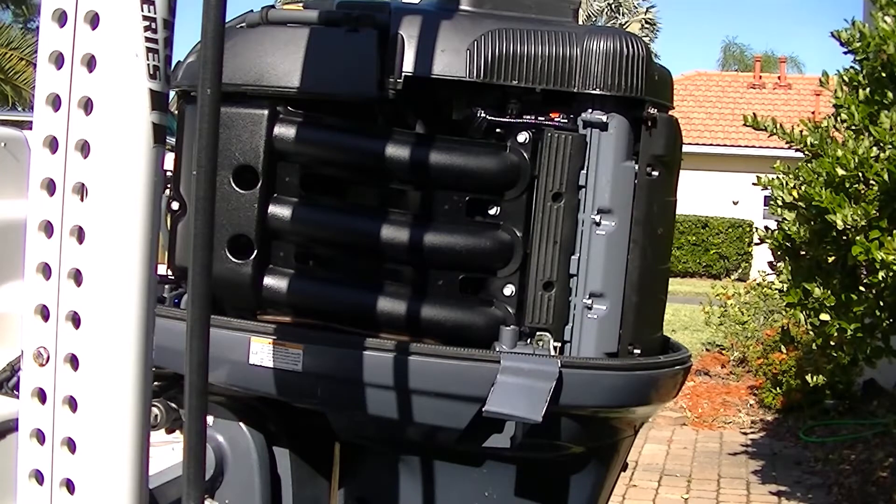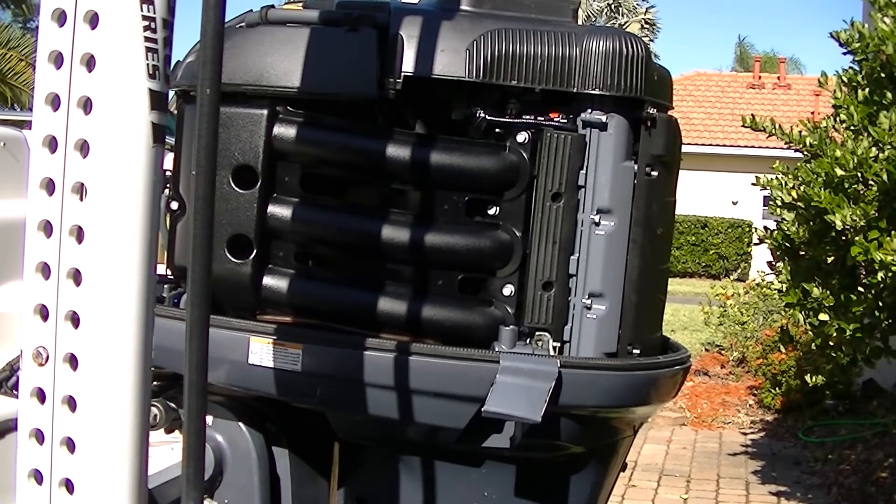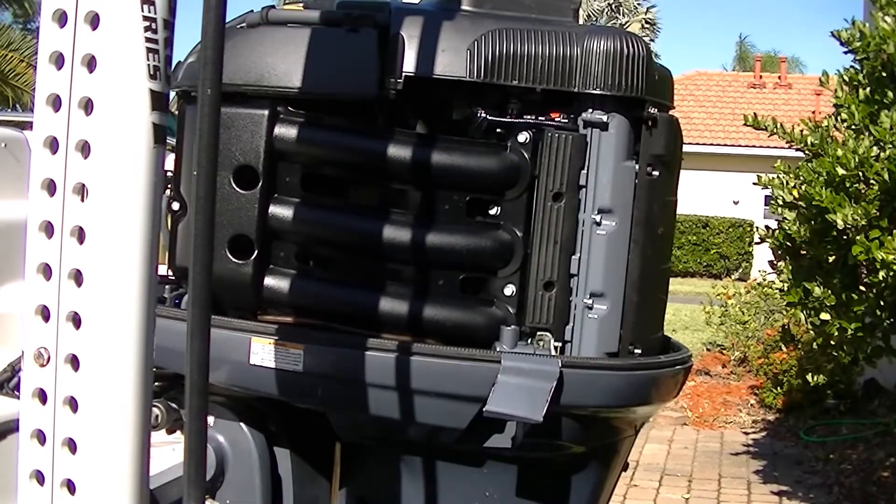We ended up having to squeeze the primer ball about 13 miles offshore till we got back to port, and we could only go about five to seven knots. We're going to look at the fuel system today to find out what is wrong. We've already checked fuses and electrical issues. The primer ball is working because we can manually do it, but it does have a little dry rot so we're going to change that out anyway. The engine is approaching 12 years old with 360 hours on it, so there are probably internal filters and potentially fuel pumps that just need to be changed out.